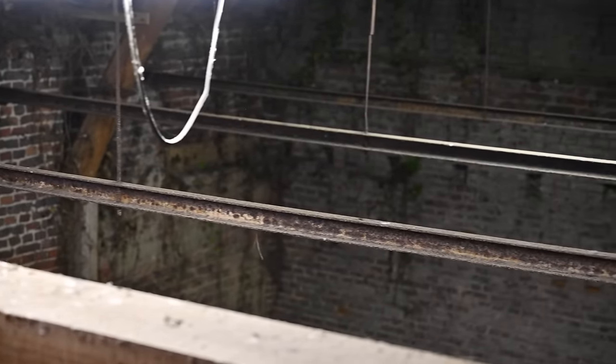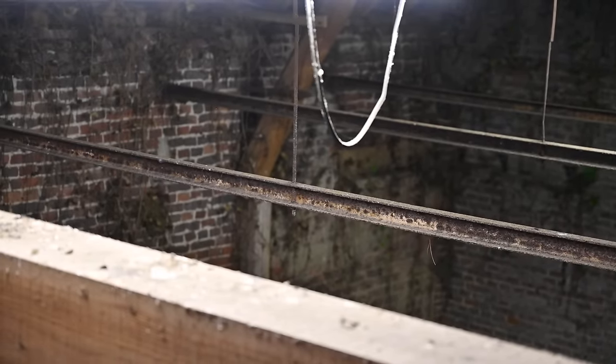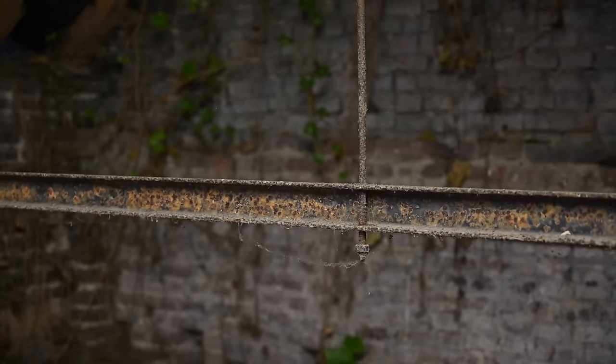We'll also need to shot blast those metal bars spanning from one side of the barn to the other — they hold the walls together because this was a potato farm. They filled potatoes almost to the roof and the pressure would push the walls outward. Somebody asked if these were railroad bars — no, they're not. I think they're leftovers from World War One when a cannon was installed here at a military headquarters on the farm. Those bars will be shot blasted and painted with anti-rust paint. If you look closely, one rod's nut is about two inches below the bar, so we can cut that off.